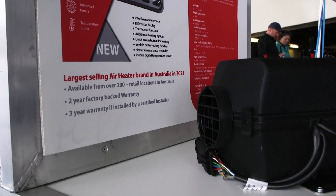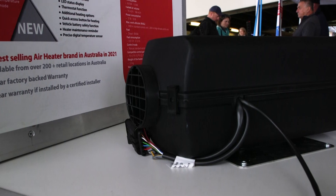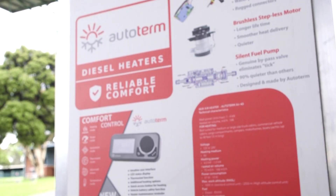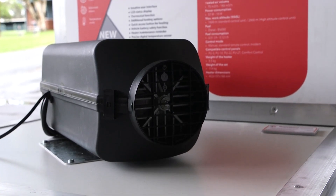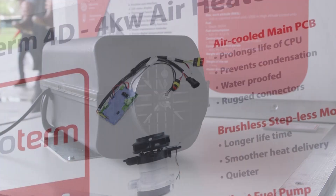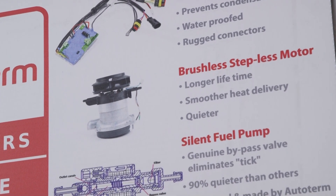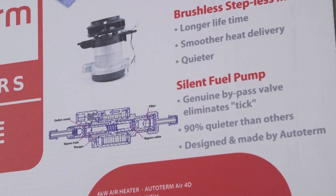It's a very tidy way to get heating into your van. Mike, this unit seems to have been running the whole time today — how long can it run? We can just keep it running 24 hours a day, there's no limit on it. We mostly use a 10-litre tank on the outside of a caravan and that 10 litres will give you about 100 hours of burn time — it goes a very long time and is very economical.